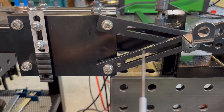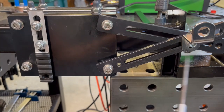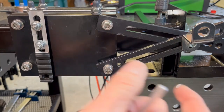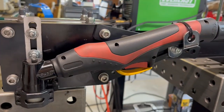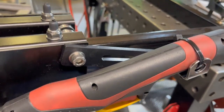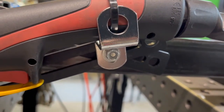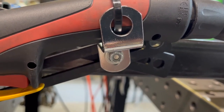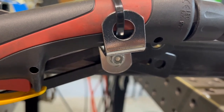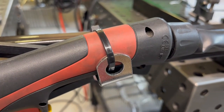These are from previous projects — these are fender scribes. This is a Harley soft tail horn bracket, so if you put on a different torch, all you've got to do is loosen up this bolt right here and move it around until you get the proper height. Here's a shot of the torch inside the holder. This bolt can be loosened for different torch heights — actually different torches — and I have the obligatory redneck retainer slash zip tie.